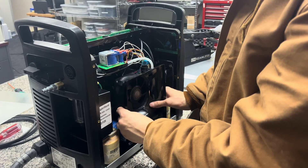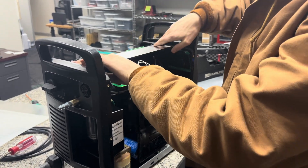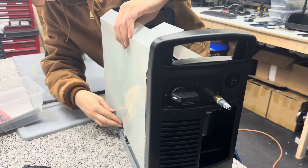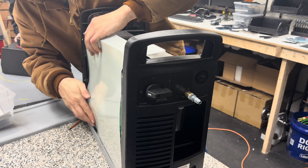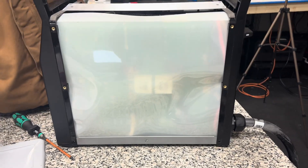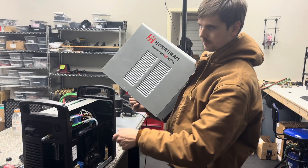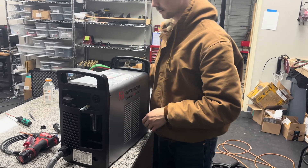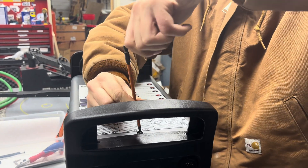Make sure you put the fan on — it's a lot easier to get it on than off. Stick it back on top of there. Take your cover and put it on like this, kind of behind the panel. When putting the cover back on, make sure you get the fan shroud next to the fan. Then start all screws by hand so you don't cross thread them — there's a little brass insert and it's pretty easy to cross thread.